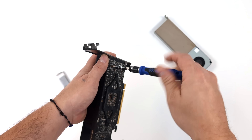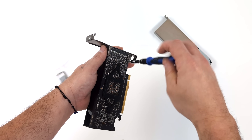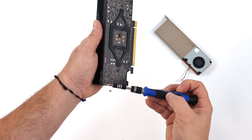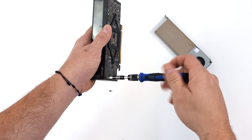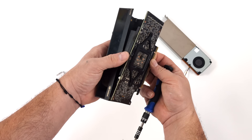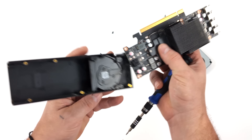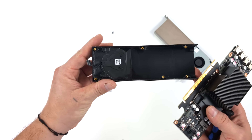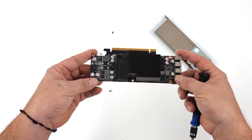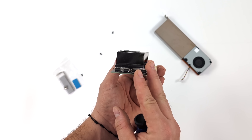First things first, we need to disassemble the A2000 — get rid of that larger shroud, fan, and heat sink underneath. This A2000 has definitely been through it; I've bent the bracket a little and used it in all kinds of builds. We've got a low-profile bracket for it but of course it's not single slot. Getting the shroud off is pretty simple: pull all the screws, take it off, and unplug that blower-style fan. The heat sink itself is surprisingly small — it's aluminum and there's just not a lot of mass there, so I think we'll see lower temps with the new Nerdware cooler.